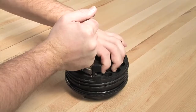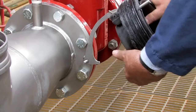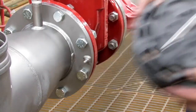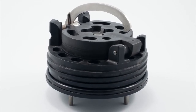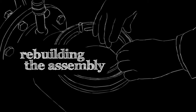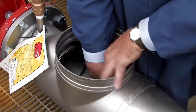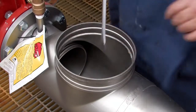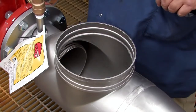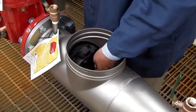The 2.5 to 4 inch checks should be closed by hand, while the 6 inch checks should be closed with the help of the opening stud found on the outlet flange. Finish by thoroughly cleaning the o-ring groove and lubricating the o-ring with an FDA approved lubricant. Checks should be reinstalled hand-tight in reverse order, with the number 2 check going in first followed by the number 1. The number 2 check should be tightened by placing a long screwdriver between the lugs and tightening firmly. Tighten the number 1 check by hand only.